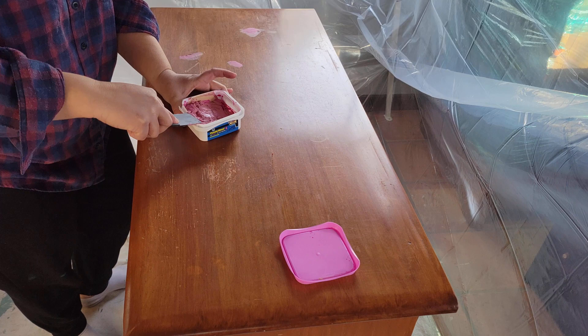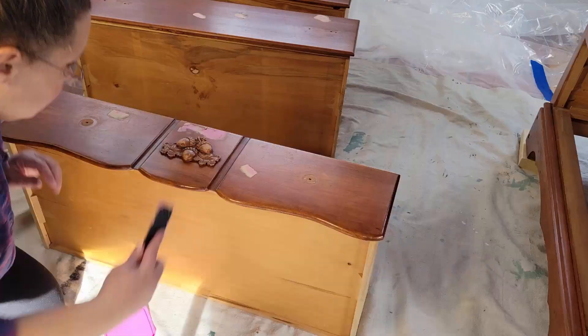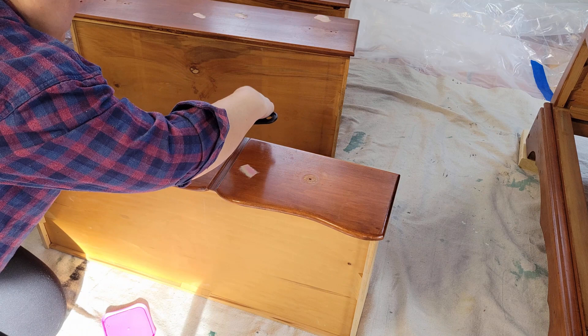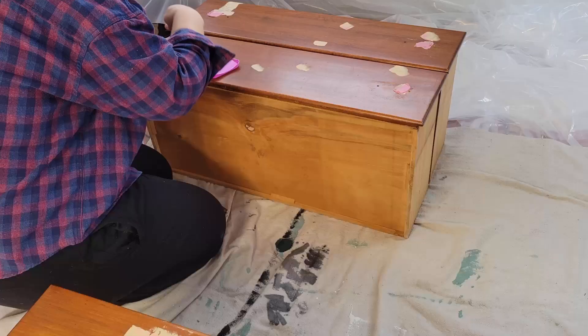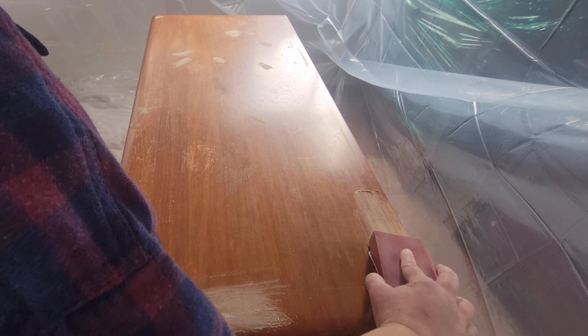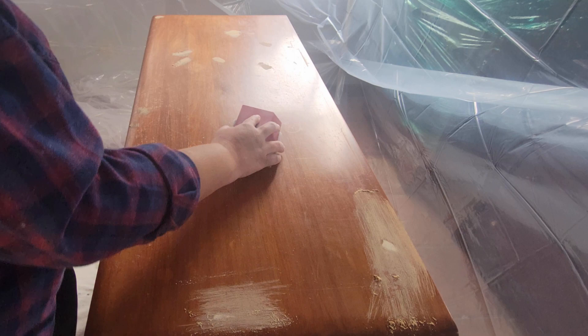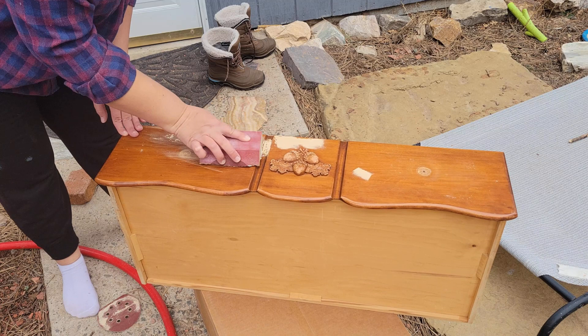This is the product I've decided to use for the scratches and hardware holes that I want to fill. I don't have any major repairs on this piece — if I did, I'd use something more like Bondo, which is a little stronger. This is my first time using this product. I really don't like Bondo and wanted something a little easier to use. This stuff does dry out really quickly, so I wish I'd gotten a smaller container. I did end up really liking it for minor repairs on furniture. You do have to be careful when sanding — use a light hand when you get towards the scratch.